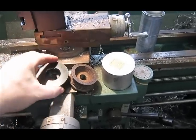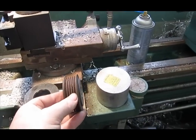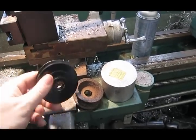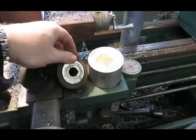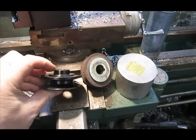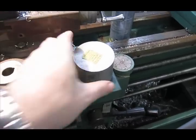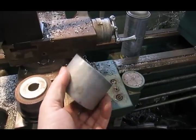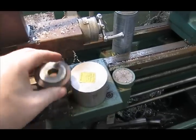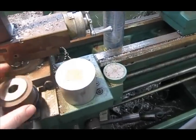I'm going to use my lathe to make a kind of hybrid pulley for an alternator. This is one type of pulley that has multiple ribs in the belt. That's steel, and this one is also steel, and this one is made just for a V-belt. The hole diameter isn't the same — this one is too large, and it needs a little step, so I'd have to add material and machine it to adapt this pulley. What I'm going to do is use a block of three-inch diameter aluminum and machine a new pulley that has the grooves of this one, yet has the hole diameter and shoulder of this pulley. So that's today's project.